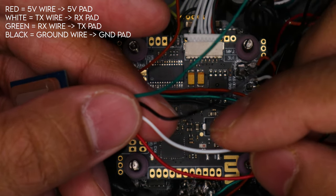Next I'll go out in the field and actually show you how everything works. In this clip you can see my entire OSD — everything you're seeing is what I saw when I was flying for the first time with the GPS on. I have 11 satellites connected — now it's 10, 9, 8, it keeps fluctuating — on the bottom right. I have an arrow pointing home on the bottom left with distance to home, the speed I'm flying at, and at the top you can also see the longitude and latitude numbers. If I flew a certain distance and clicked my GPS Rescue button, it would automatically level out, activate GPS Rescue mode, and start flying back toward me after climbing to the altitude I set in the CLI tab.